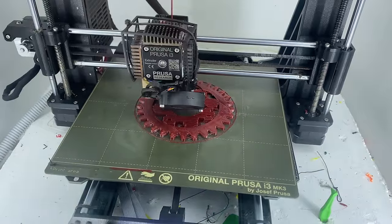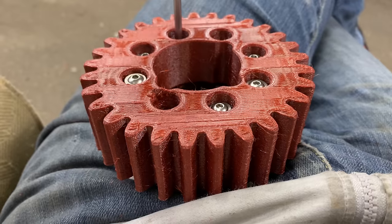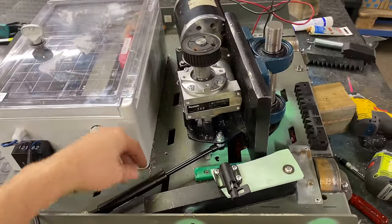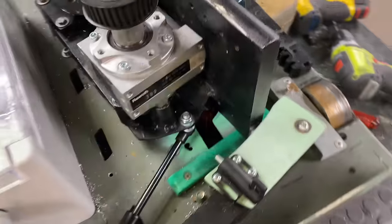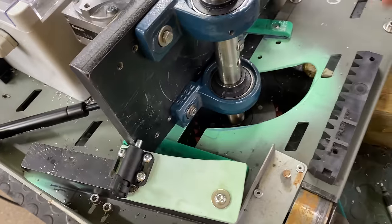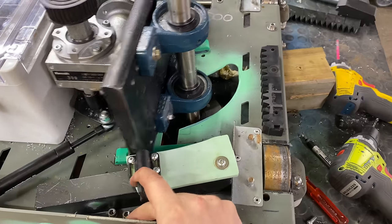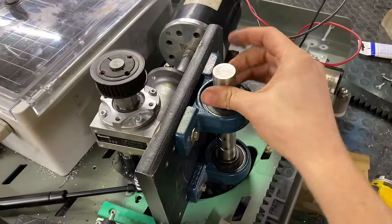Steel gears are loud and expensive so I 3D printed mine — it's much cheaper, just six euros, and I can play around with the gear sizes. This thing pushes the gear down towards the rail underneath. I added one of these snappers — you pull it with both hands, now it's locked, so you can put it on the rail without the gear engaged, otherwise you can't get it on. Once the cart is on the rail you pull this and it re-engages. Really simple.